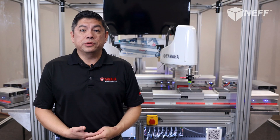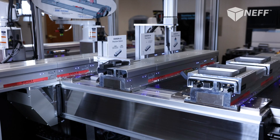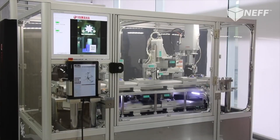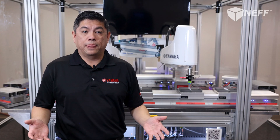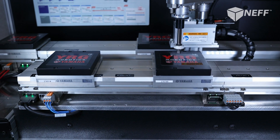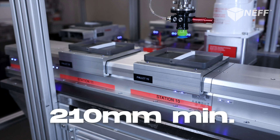Typically the LCM unit is used to compact an assembly line in a straight-line process. Instead of using a circular dial table layout to save floor space, you'll find it very flexible to lay out multi-layers to solve your transportation problems or overcome bottleneck issues with mismatched cycle times and automation processes. The LCM can be used in multi-layer double or even triple deck with an elevator transfer, or a side-by-side horizontal layout. Some even like to use the LCM like a long assembly walking beam. Floor space is typically a premium for most manufacturers, especially in Japan where stacking the LCM is preferred. In North America, side-by-side is preferred for access reasons. Station-to-station compactness of 210 millimeter minimum centerlines between stations can be achievable.